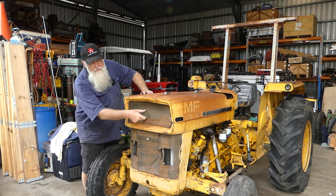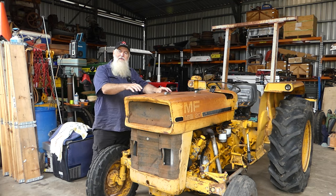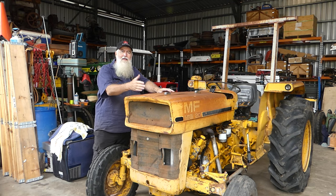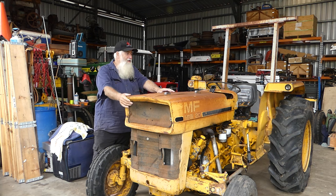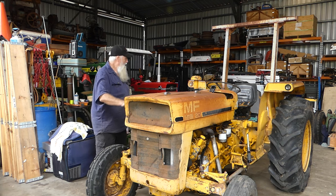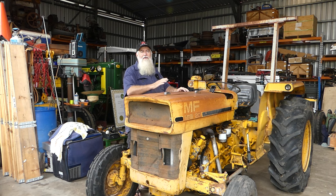It should have an emblem across here — the Massey Ferguson triple triangle — but then they had the industrial upside-down loader bucket with Massey Ferguson on it. I'm looking for one of those if anyone knows where there is one. The guards are a little bit rusty, it's got a Flatford roll frame on it — that's a good thing. I've had a play with the hydraulics and worked out the hydraulic valve works, and the pump seems to be pumping up to the standpipe but it's just not working, so we'll run through tests there.